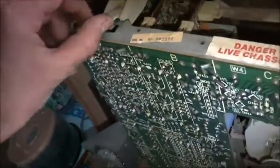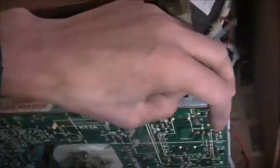Alright, I'll show you the other flyback I got. One of my other little vintage TVs. It's a very interesting one. This is a fairly low hour Fujitsu General TV from 1979. Colour, Hitachi tube. Hitachi were pretty darn good for CRTs back then. Very high quality. They also use a bonded yoke, which you cannot remove without breaking the CRT. Made in Japan. There's a little picture chip guarantee in here as well. That's how good they are.